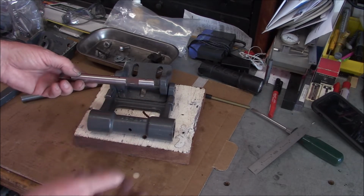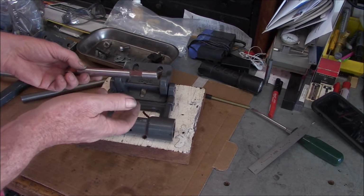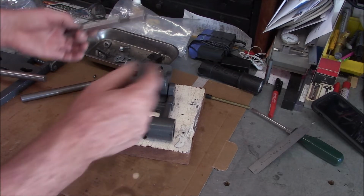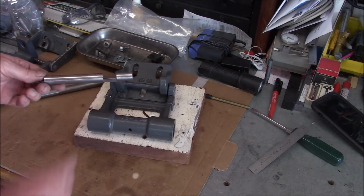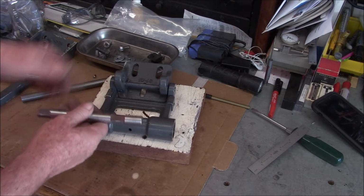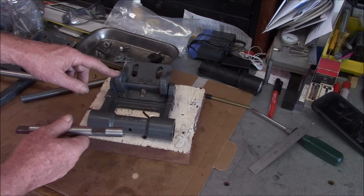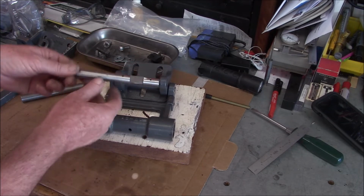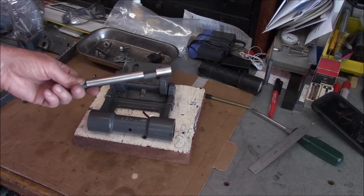So it's pretty good evidence that this machine's been tipped over, because one belt guard was missing, the oil pan is broken on one corner where the stud comes out, and then this would have been in that same area. So this machine's been tipped over, but luckily the casting is straight. I checked both these castings; they're straight. So the shaft took all the brunt of the crash. So at least that's a relatively easy part to make.